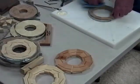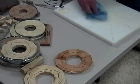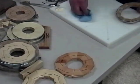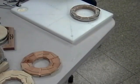Tom asked a good question there that I probably should have mentioned what I was doing. As soon as I had the glue on, I started pulling the pins out to release the rubber band. The rubber band actually does the beginning of the work for me. And once I get all the pins out, then I just go through and make sure all the segments are snug. And I just wipe this off with a rag and water, and I'm ready to go for the next ring.